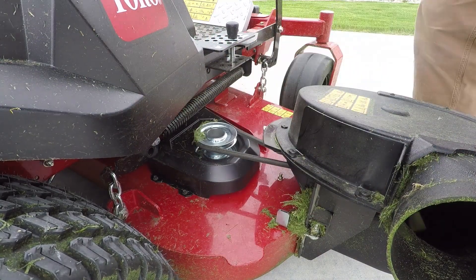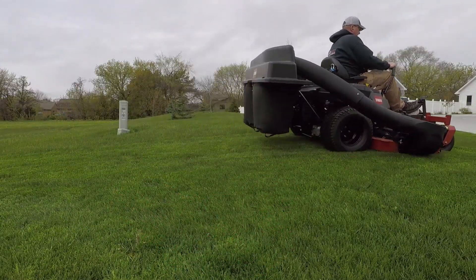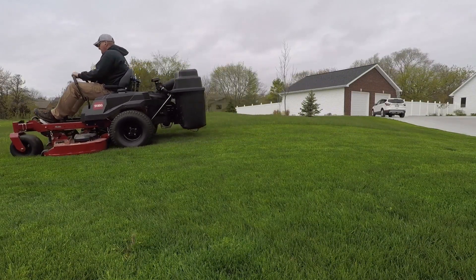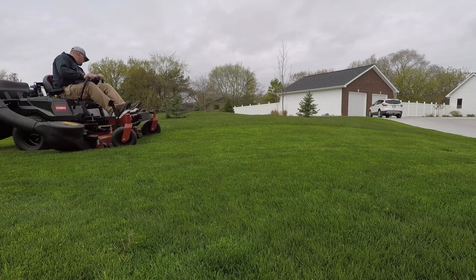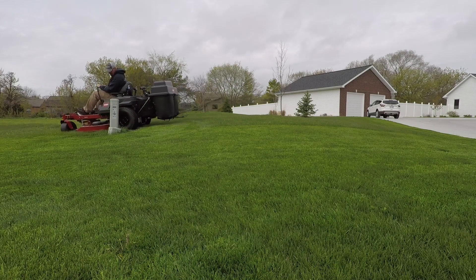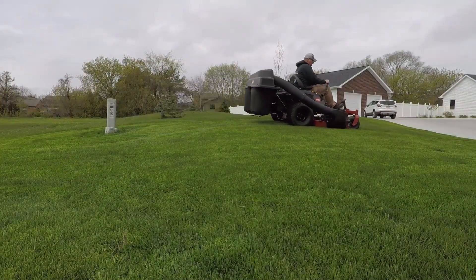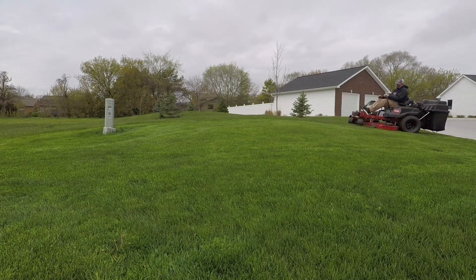The bagging system here is powered basically by the drive system that drives the mower blades. When you're mowing grass, you have to slow down just a touch while you're bagging if you're in long grass. It will audibly tell you that by making a sound like you were driving over a bunch of little twigs with the lawn mower. That sound comes from the power unit on the side, telling you that it's pushing as much grass as it can physically push at that point.